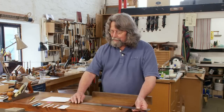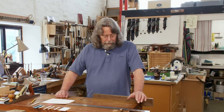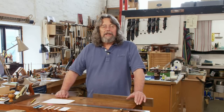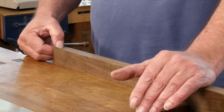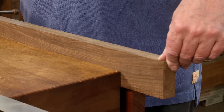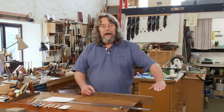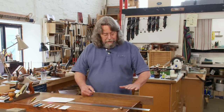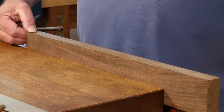What I was taught 40 years ago was that the way to get a straight edge was first to deliberately plane it hollow. I do this with what I call stop shavings. My shaving will start just inside this end and finish just inside that end. If I continue to do that I will be getting rid of the bump and attempting to hollow this edge.